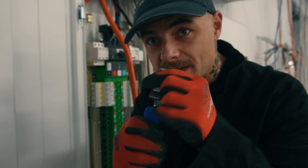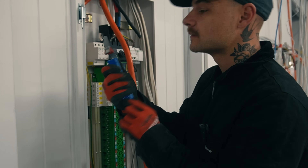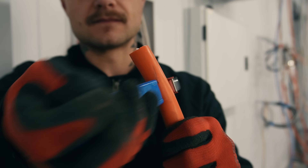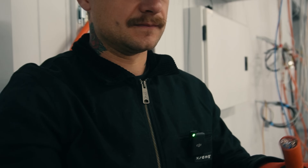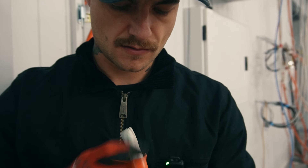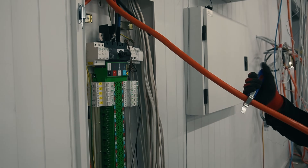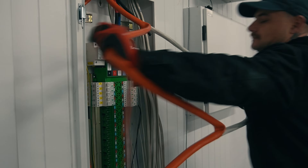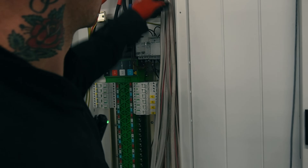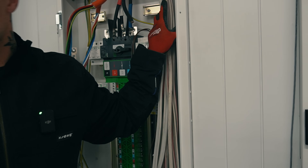With these, ideally you wouldn't have that knife on there. You can set your blade with this dial on the bottom. I normally do a little test - I only grab the end of the cable, clip it on like that, spin it around and pull. I'll just do a little test on the end of the cable to make sure I haven't gone through any of the cores. And that's cut it perfectly. So I know that's set to the right depth.